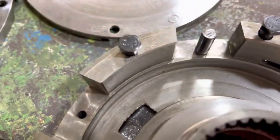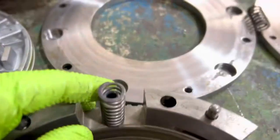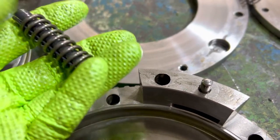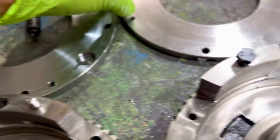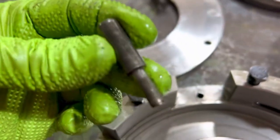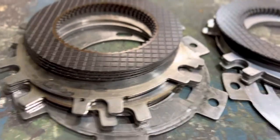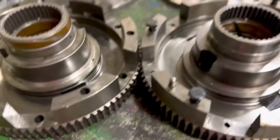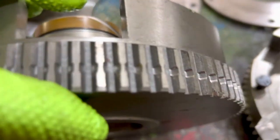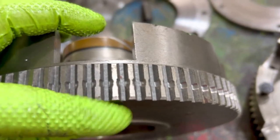As a combo they are a little different, but this design was used for 20, 30, 40, 50, 55, and 60 series power shifts. They use the same amount of clutch discs, the same amount of steel discs, and the same exact piston number by mark. What does go wrong with these is your clutch will cut into your splines.